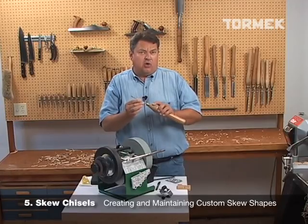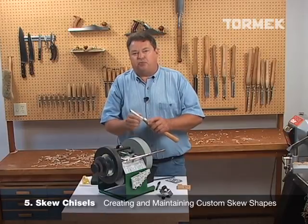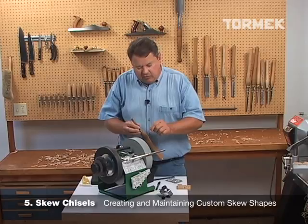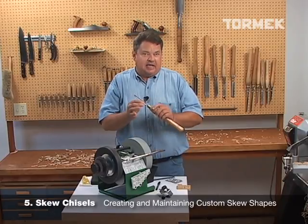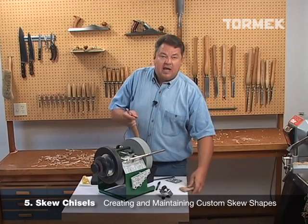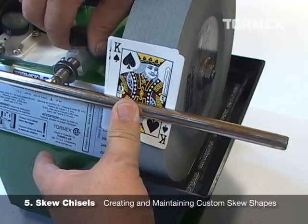I've used it for so long that the blade length is too short for the TTS-100 protrusion measures to be effective, and the universal support has to be really close to the grindstone to get my bevel angle. So I made a custom 2-inch stop block, and my spacer block is 2 playing cards.